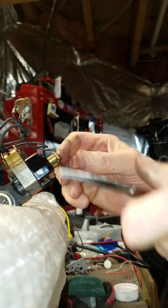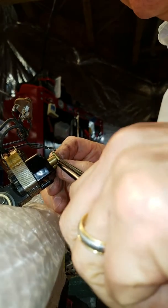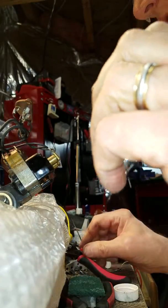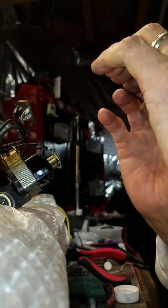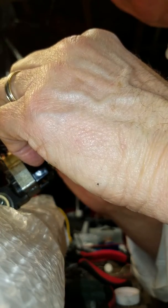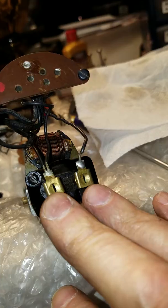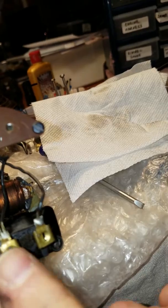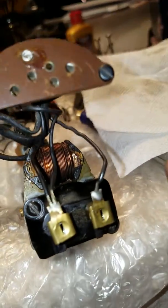Try this side — just a love tap, not a bear hug. That's better. It could be a little tighter. What I may do later is take it apart and tighten it up more, but I don't want to fuss now. So what I need now is a patch panel tender that I could plug into this and distribute the power across. At any rate, that's how you assemble the springs and the brushes, and then you can always test — spin your armature. This one spins really nice, really smooth. So we should be in good shape. This is tight, this is oiled, these are in properly — they're dry, they're clean, they just slid right down the barrel. Everything looks great. I'm going to try to find a way to put some power on this baby — see what we got.